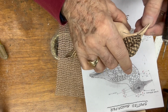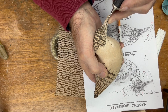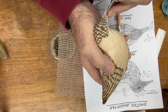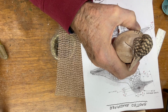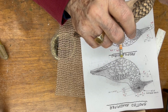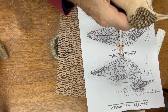That gives you a perfect nostril. Okay, and I'll do it again. I'm pushing in, but just enough to stay within the parameter of that pencil line setup I have here. And then push right in the middle, and then push in and pull out. And there is your nostril in that same groove, okay? So that gets you pretty much set up. Now what I'm going to do is I'm just going to soften very lightly with the sandpaper. Everything I did, I'm just going to sand it lightly, just in case there's any edges left over.